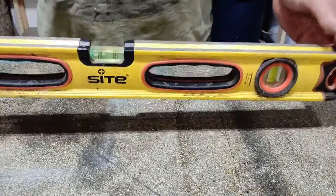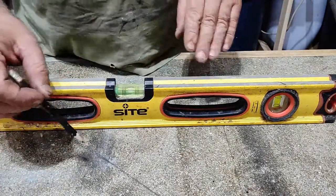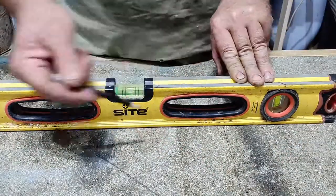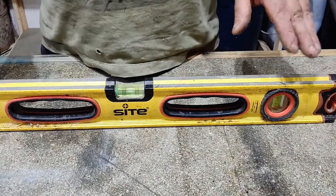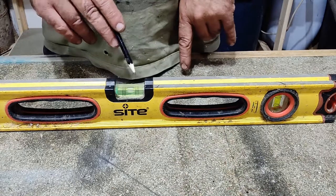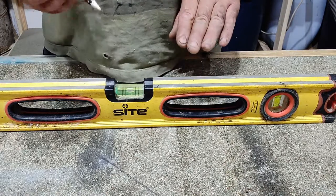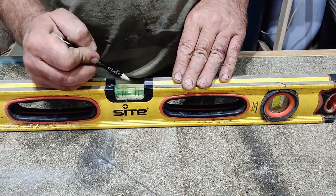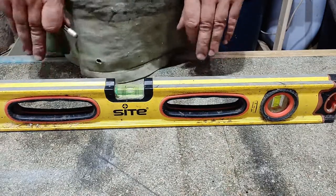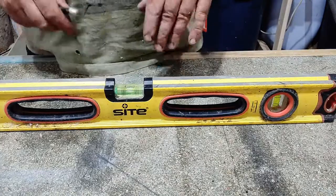So what we do is, if we want to check this level for level — the horizontal plane — we grab a pencil, run a line on it, mark the ends, and make sure we place the level in exactly the same place as we did for the first measurement. We look at the bubble, and if the bubble is hard over one side or the other, mark it where it is on the actual glass. In this case, my bench here is 100% level and the bubble is appearing in the middle, so I'm assuming the level's quite good.